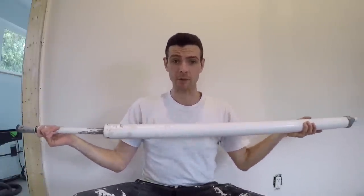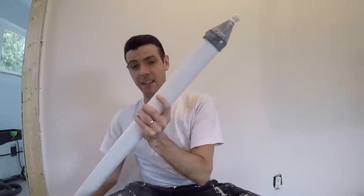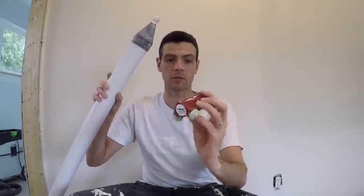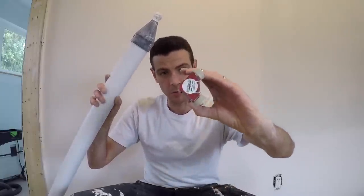We've got it on this pole here. Now in order to get the mud into the angle first, I like to use a compound tube — it's just a giant mud syringe, water cannon in the summer, I like squirting my kids with this thing. But what we're going to use for that is this better than ever corner tool. It just looks like a little toy train, but it actually rolls in the corner and applies mud from those holes. I use the two and a half or three inch for taping and the three and a half for finish coating. And when you're taping, you also use this to apply mud into the corner. And then comes the corner roller — this is what makes the nice square corner and embeds the tape. I have a room with enough corners to justify using these, so let's get in there and use them.